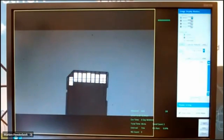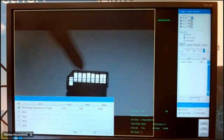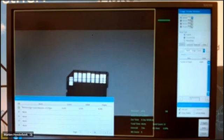And now I'm going back to run. Automatically, you see here the green button. It's okay now because I still have the 9 edges. If I add a screwdriver to it, you see the amount of edges is changing, and it is not okay anymore because I don't count 9 edges at this moment. So that's your detecting point.